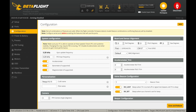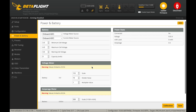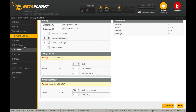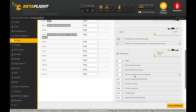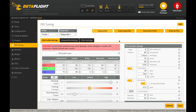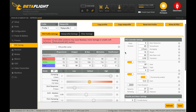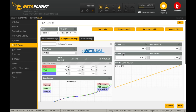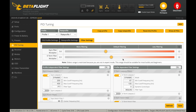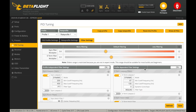As for setting it up, here you can see a quick overview of the out-of-the-box Betaflight settings that the XL10 comes with. As I've mentioned earlier, you will need to set up the GPS rescue mode by yourself. The most important thing is that the quadcopter comes pre-tuned, and this is actually one of the best things in my opinion about iFlight. They make sure to pre-tune their quadcopters, and in case you've ever built a quadcopter bigger than 5-inch, you probably know that the hardest task is to tune it.